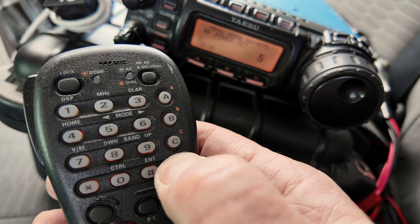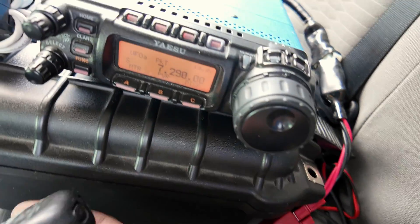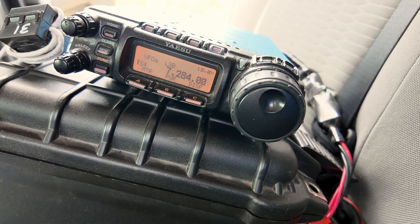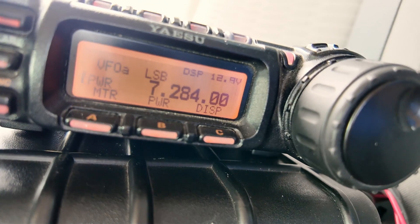The Tactical Delta Loop antenna is outside and I'm back in the truck with the 857, testing if the antenna tuner works with that antenna as well. After a quick on-air contact — calling in from down near Klamath Falls — with both antennas done, I was able to use them with the tuner. The military-style one isn't very good SWR-wise, so I wanted to see if the antenna tuner would match it, and it did a good job. The Tactical Delta Loop really didn't need it that much, but I used it anyway just to confirm it does what it says.